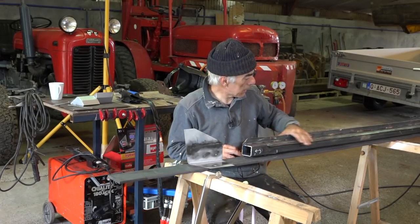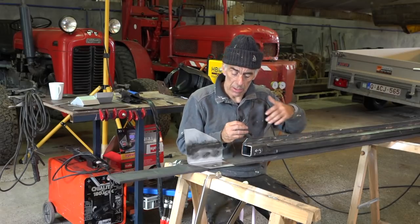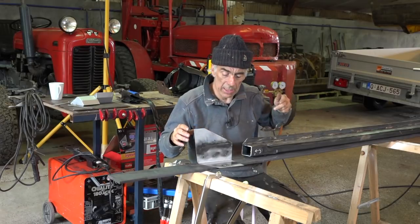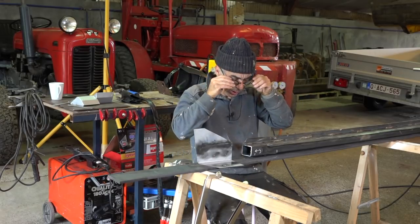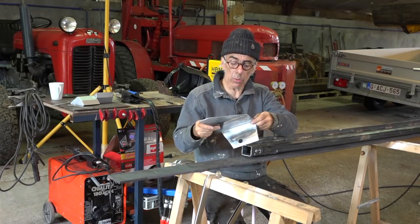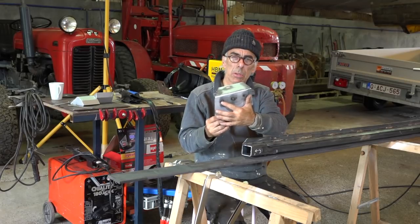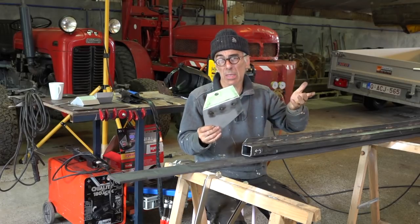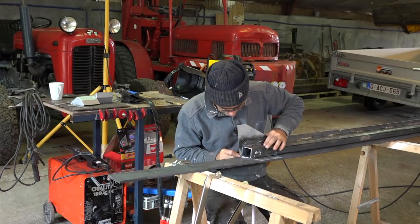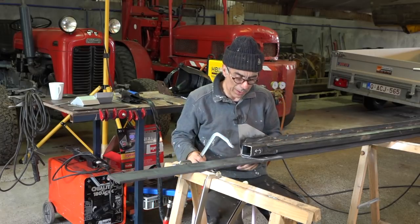It's still pretty hot. This is the one and it looks exactly like the original — I'll show you that in a little bit. Now it's time to put up these wings. I already put one wing on the other side but I want to show you this side. This is the bracket we made — I drilled some holes in the side because I'm going to do plug welding through those holes to simulate spot welding. Let's fit it in and start welding.